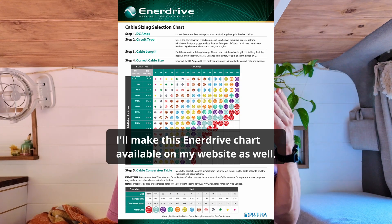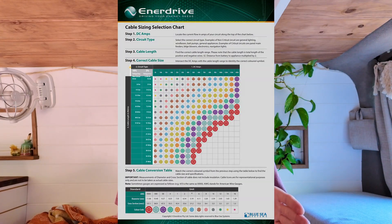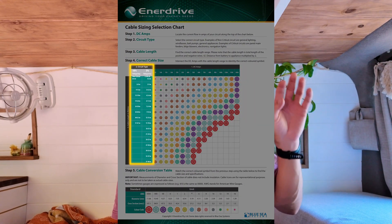Here are three tips to give you a head start in that research. First, to figure out the cable sizes for your system, it's really not as complicated as you think. You literally just Google a cable thickness or cable gauge chart online, figure out how much amperage a component is going to draw — which is easy to find in the user guide — then figure out the length of cable you'll need, and the cable size chart will tell you exactly what gauge or thickness cable to use to send that much power that distance.